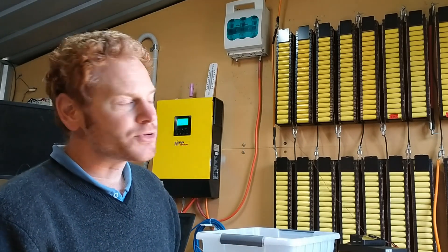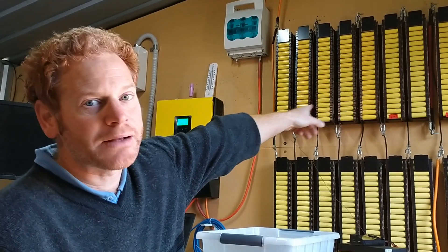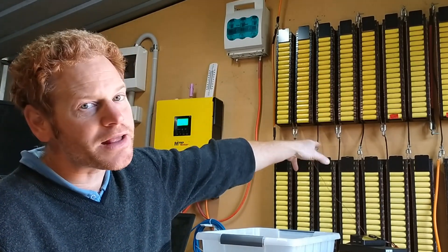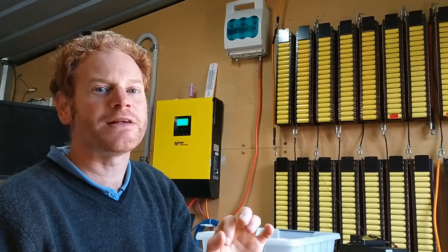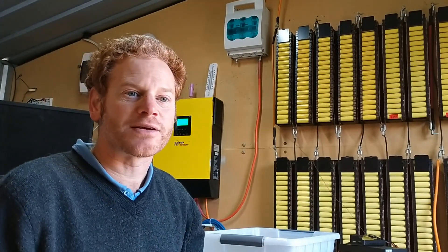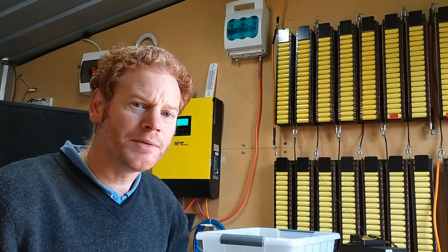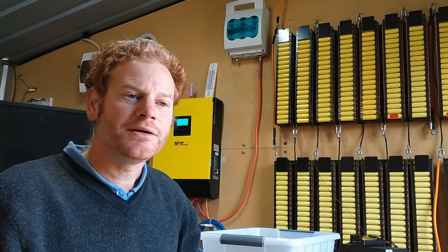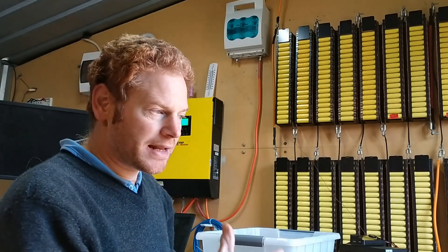As you're probably aware, I haven't got a BMS, and I did do a manual balance on them just now — but that's after quite some time. When I first started, that first half of the pack wasn't sitting for any rest; I didn't understand that at the time. But letting them rest is the key for having a good set of batteries. Because I let them settle for all that time, I always test just before I actually put them in a container.